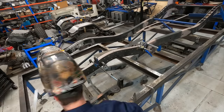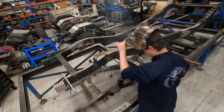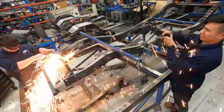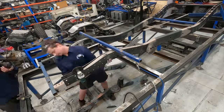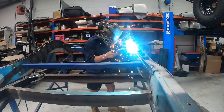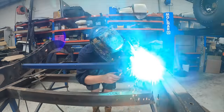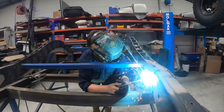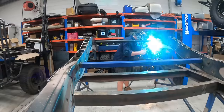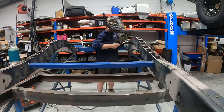Connor is now installing the outer front chassis plates, before cutting the front crossmember out, installing the inners, and then finally bracing the front of the chassis to the chassis table. Now that the front is braced, Connor is plug welding the rear plates to the chassis. There is a lot of welding and grinding in this project, so buckle in. We're doing our best to show how much work it is without being too boring — if I put all the footage in real time, we'd be here for over 10 days.